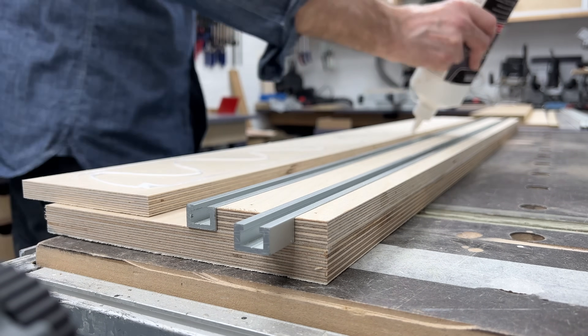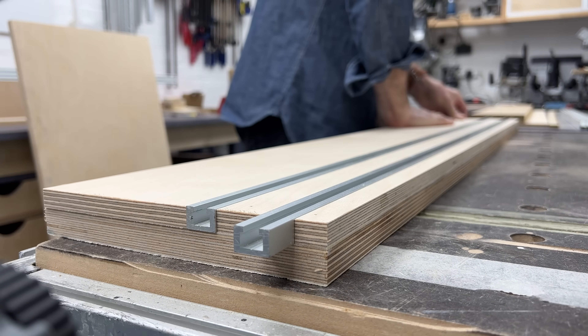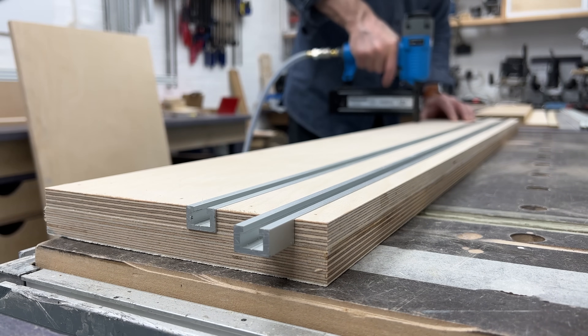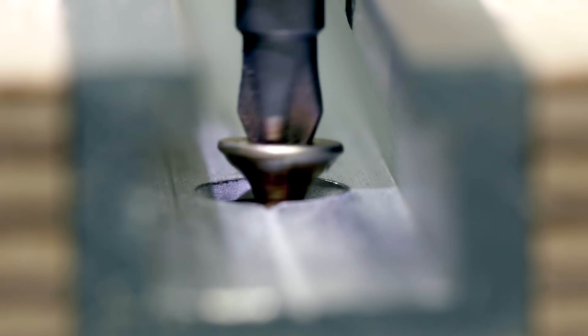The placement of these tracks is entirely up to you. Just be aware that if you're using one of them for a front rail support, setting it too low will reduce the maximum depth of cut on the bench. The T-track is simply screwed onto the birch ply — even the tiny 3×20mm screws should hold just fine.